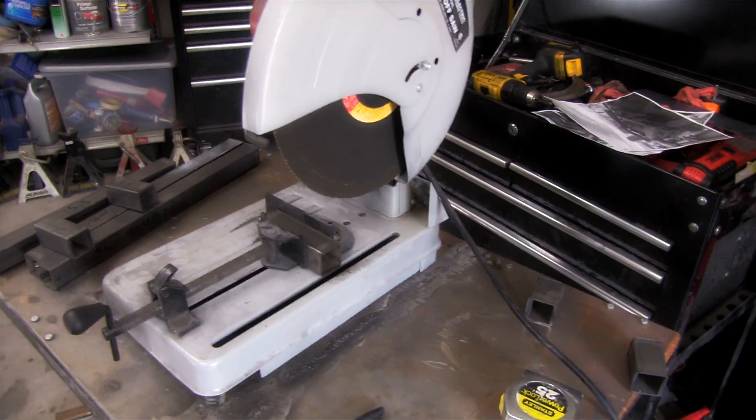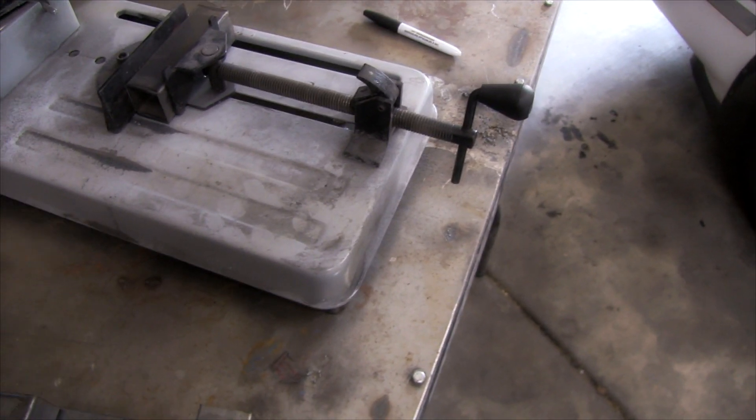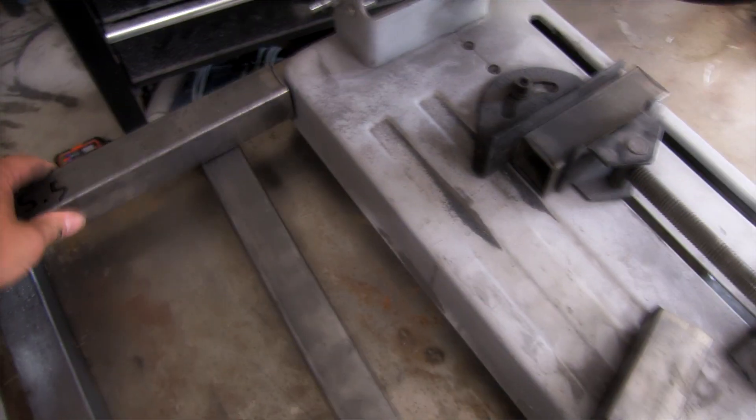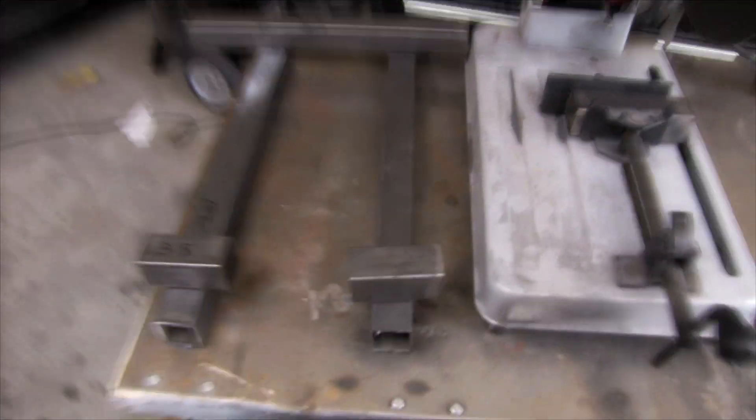Using my Chicago Electric harbor freight cutoff saw, I've come up with these pieces: one 20-inch piece, one 15 and a half inch to go across, and two 3.5-inch pieces for support in the back. What I'm going to do is basically assemble these and tack weld them. This front piece will go like that and I'll tack weld it on, and on the back I need to figure out where to put these support pieces, with a flat angle iron piece going across here to brace it.